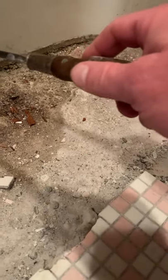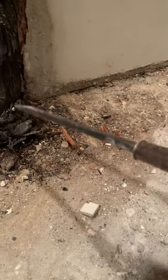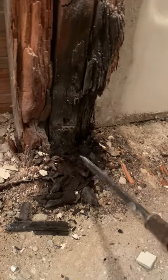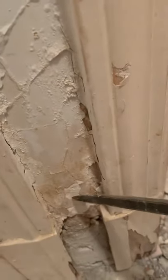I'm guessing that somewhere below this tub, or at the level of the bottom of the tub, there's a pipe or joint with a hole in it — but we can't get access to it yet. We're going to continue working through this. You can see this wood here is absolutely gone. The only indication we had — and I didn't even realize this until last night — was that between these two areas the paint started bubbling, and there's a stain on the wall. That was it. The concrete board in there is still solid, not mushy — old house problems.